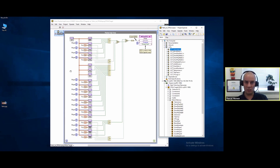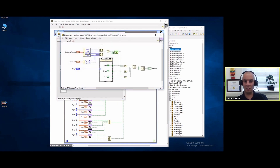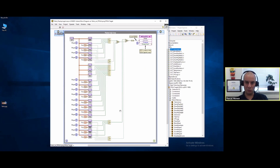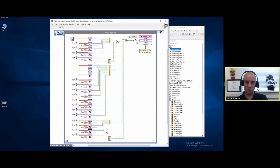The rectangles are done programmatically - the draw rectangles code checks again if the active pixel being drawn is inside a boundary. If so, depending on the player, I select the color: red, green, blue, and magenta, and this goes to the output. There's additional logic because I'm drawing the astronaut, but the game board actually overlays it. So the game boards will always be drawn instead of the astronaut - that's basically the logic you can see here.